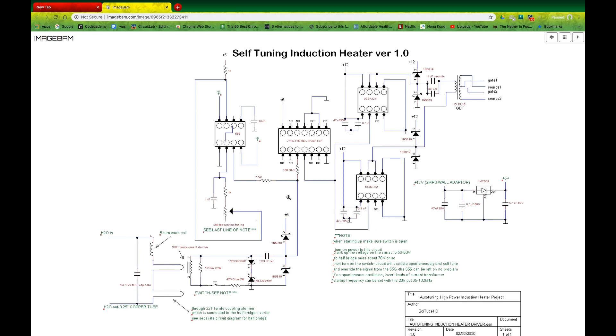When you just start this thing up, you need a switch in place right here, because the weak signal — which is further weakened by this resistor — would go and short directly to ground if the switch was closed. It would just go right through this resistor and through this coil directly to ground, and the hex inverter would see no signal. So at startup, this switch has to be open. Then, once you start getting some current flowing in the tank circuit, you can close the switch and resonant action takes over, and pretty much any small signal from this 555 is ignored.